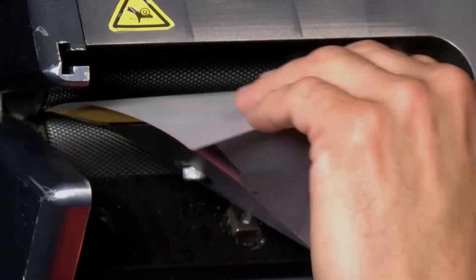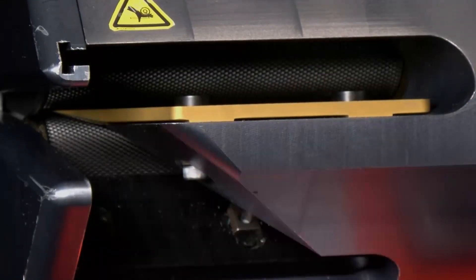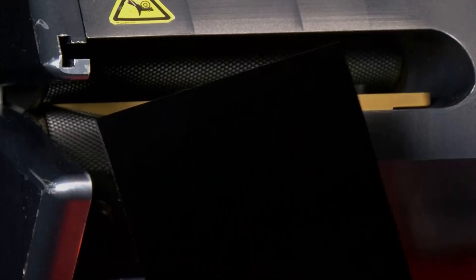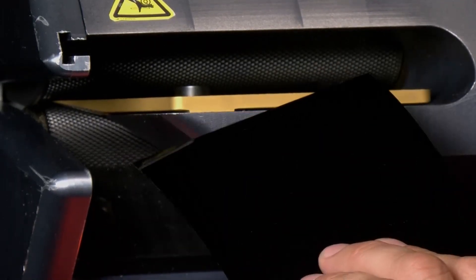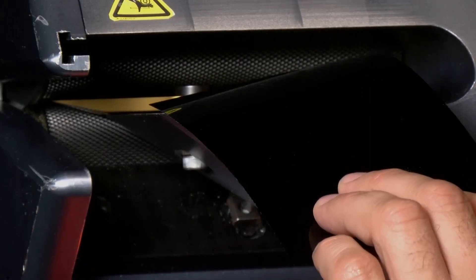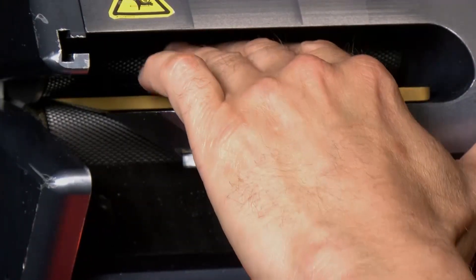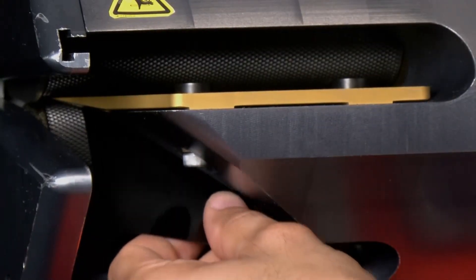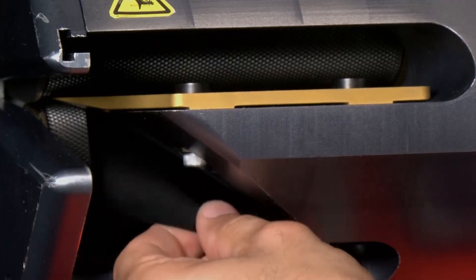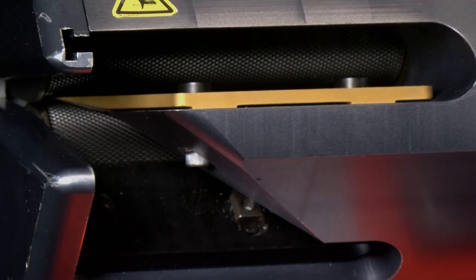As you can see, it freely goes between the blade and the roller. The black shim represents the no-go gauge — this should not go between the blade and either of the rollers. As you can see, it freely goes between the blade and the top roller, as well as the bottom roller and the blade. So our next step would be to adjust the rollers closer to the blade.